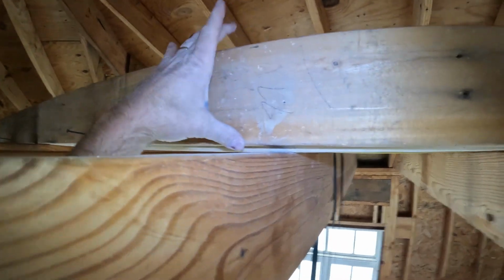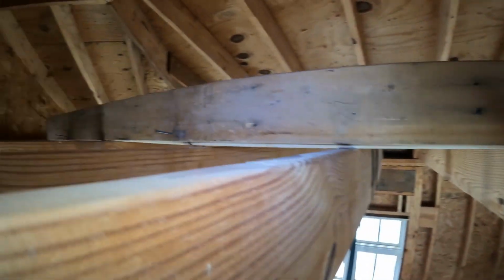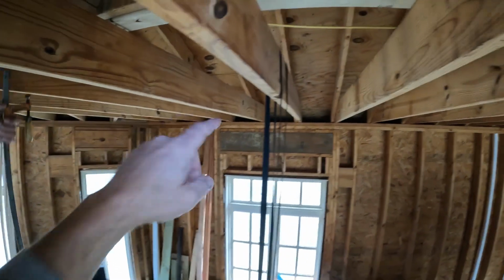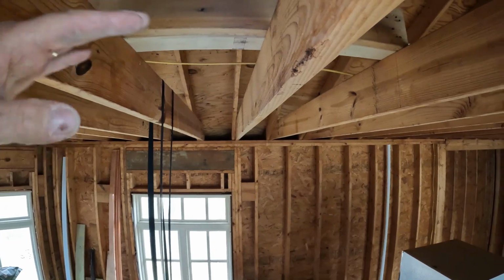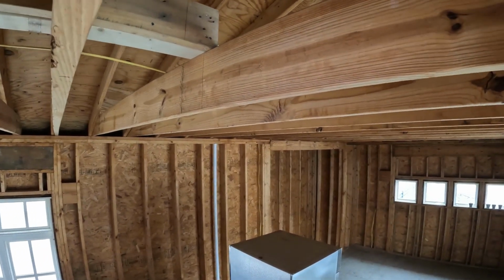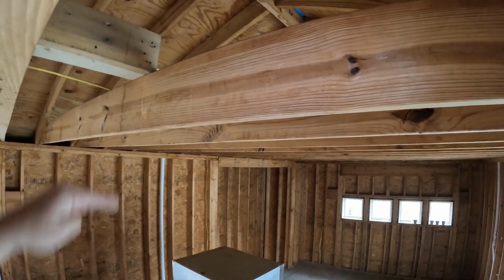So we're gonna have to have a bar clamp. Clamp on the top, clamp on the bottom of the ceiling joist, and we'll clamp them together. And then we'll just screw the piss out of it and make it a little more rigid. But regardless, we're gonna have to come in and sister up 2x4s right here to get the ceiling flat anyhow. So I'm not really trying to keep it super straight. I'm just trying to give it some rigidity, and then we will come back in and put the sleepers or the sisters up here just to make it cosmetically flat.